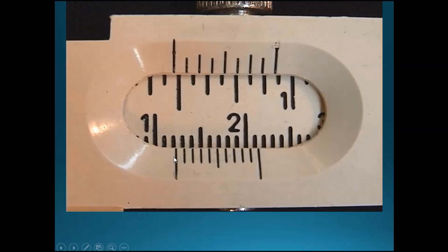Now we're going to read the micro reading, which is taken from the vernier scale portion. You must check which of these 10 lines actually matches up exactly with the lines on the top. This line is a bit off to the right, this line is still a bit to the right, and this line, even though it hits this part, is still a bit to the right. However, look at this — this line is straight in the center of this bar. The next line is a bit to the left, and the one after that is even more to the left. So this bar is the best matching point.